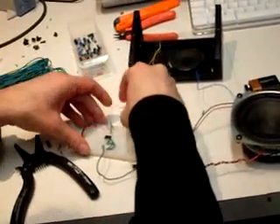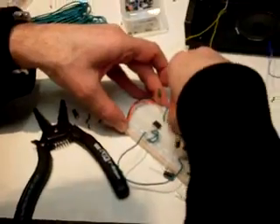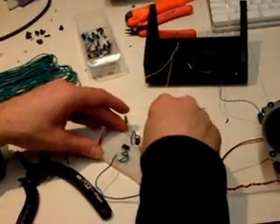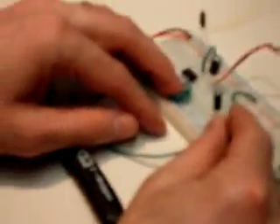If you want to get into doing some circuit bending, circuits like these are pretty easy to circuit bend. If we just hook up another oscillator on the other side or something — let's try something that is not in an audible range. Here's a one microfarad capacitor. So if I hook this up, I've got this pair here. I'm going to skip this pair and go to this pair. I'm just going to make another oscillator and use it to modulate the other one.